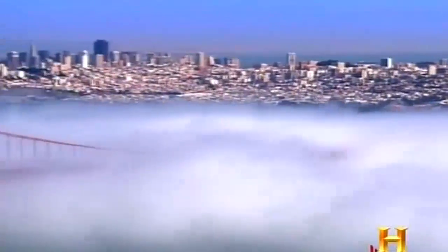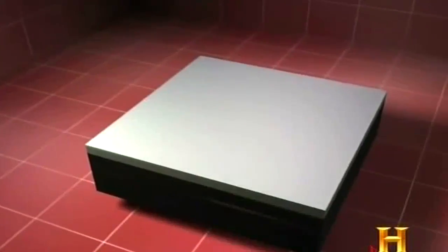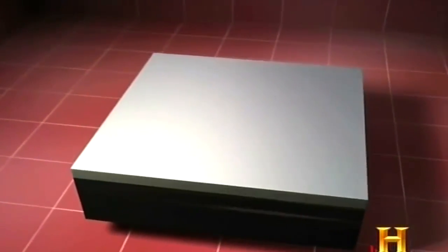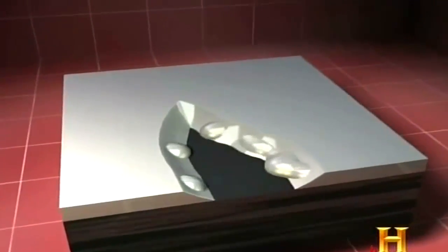There's talk of putting microprocessors into paint films, where these microprocessors in the paint are continuously informing, say, the bridge engineers as to what the wind shear is that the bridge is being exposed to. There has been some development of paints that can heal themselves, essentially using an encapsulation technology where you have small amounts of material in the paint that when the paint is ruptured, it releases a material which will move to the ruptured area.